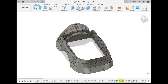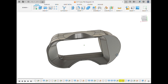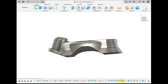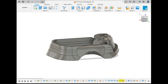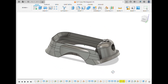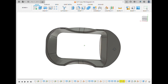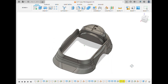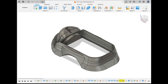The Carry Magwell is a low profile magwell that helps with reloads while being minimal and allowing magazines to be stripped with the relief cuts on the sides. It has an angled back designed for concealed carry, as that is where the firearm will usually print. All these magwells have bumps on the sides that help fill in the bottom part of your palm — like a little mini palm swell. I added this feature because it felt good in my hand and added a little bit of stiffness and rigidity to the sides. This style and the next both work with factory magazine base plates as well as Magpul and ETS mag base plates.